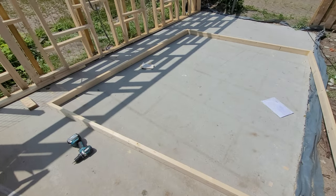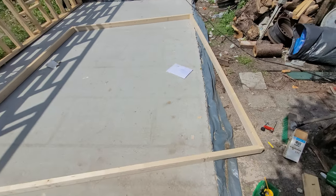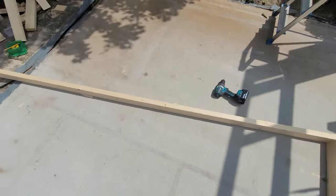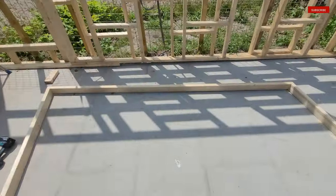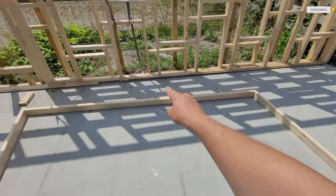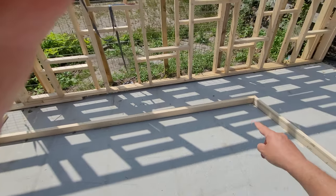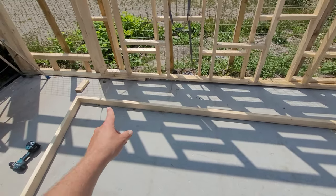Alright, so I said I would go to the hardware store and buy a larger angle to have 90 degrees, but I was thinking, how do I know exactly when it's 90 degrees? I know this side here is 300 centimeters, that side over there is 240 centimeters. So to make a triangle, I started at 240 centimeters across that corner over there, so I got a triangle with a 90 degree angle. I knew that side was 60 centimeters and this side was 300 centimeters, because that's the length of my wall. And with a bit of calculation, I knew the angle.